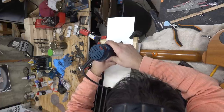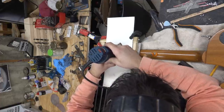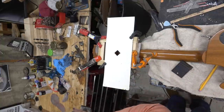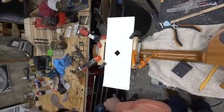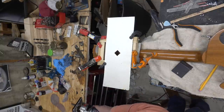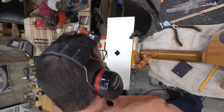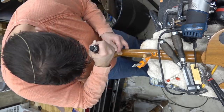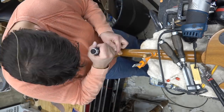This isn't a bearing bit — it just has a flat spot that I'm using on the template, so it's not gonna cause me any trouble. Double check how it looks. After that first route we look good, and come back with the chisel to clean it up a little bit.